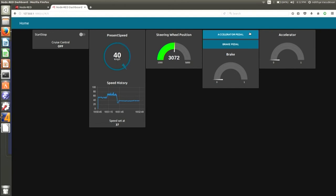This is just a demonstration of what our PLC can do — this is not our entire project. Our entire project is the PLC board that we have designed and configured. We've also converted many existing applications written in ladder diagram into function blocks, and we are now complying with IEC 61499 standards.